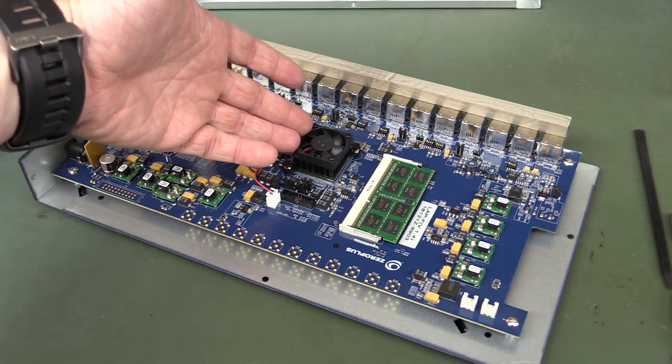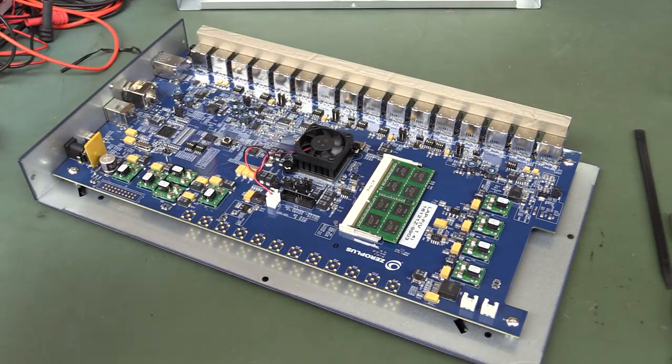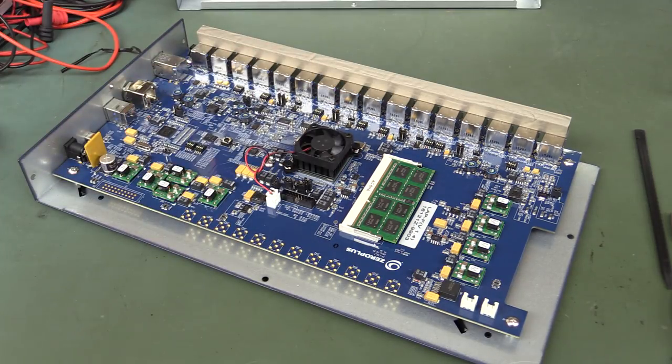Although this would have protocol decoding built in, it'd only be for the purposes of trigger, I believe. They would be sucking the data out and then doing the full memory decoding, I would presume, in the software on the PC. But you definitely want protocol triggering in the hardware. It's useless if you're doing it on a PC. You've got to wait until it streams to the PC first, use the PC to decode it, and forget it. Your data's already flowing off by the time your PC triggers. So all the protocol triggering is done in hardware in there. That's a sweet bit of kit.